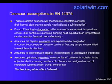Stepping back before we do, the dinosaur assumptions in EN 12975 are that the quadratic equation will characterise collectors correctly. It won't if there's a thermal step change. A thermal step change is something like the use of thermochromics to control temperatures, or for example a thermostat which opens at a certain temperature and allows air to vent through a panel and cool it. That is not a constraint for our technology, but it is for other technologies which use solar thermal and polymers. The next four constraints do affect us.